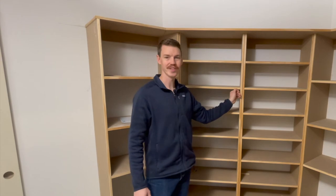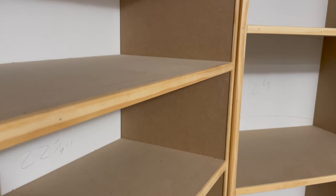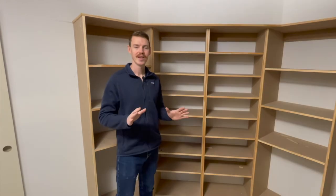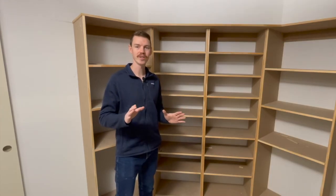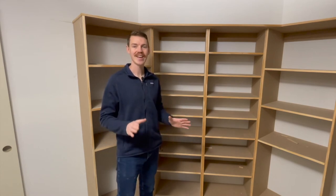What we've also done is come in here and just nailed it with little pin nails. These little pin nails are almost invisible, and we'll just patch them up with a little bit of compound, sand them flush, and then this all gets sprayed white. We usually use a Sherwin-Williams product that is meant for doors, moldings, and cabinets. It's a super hard, glossy finish — it just looks fantastic.